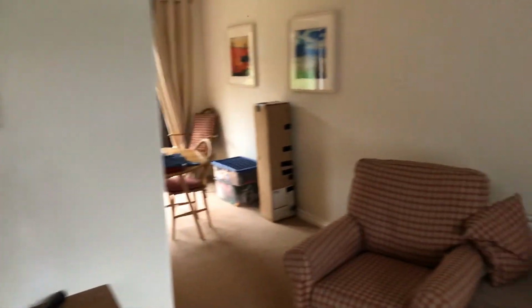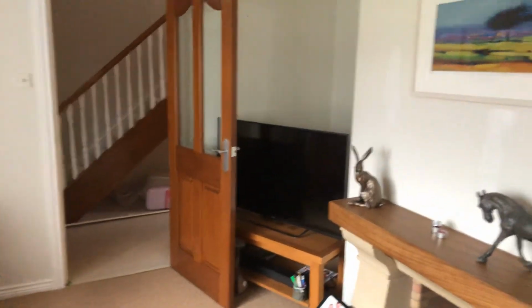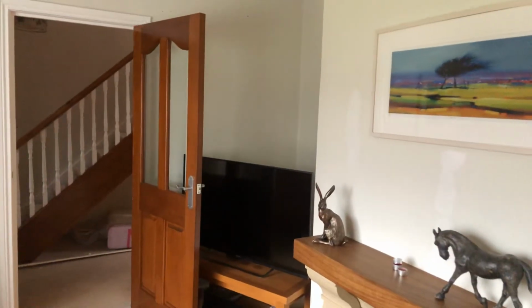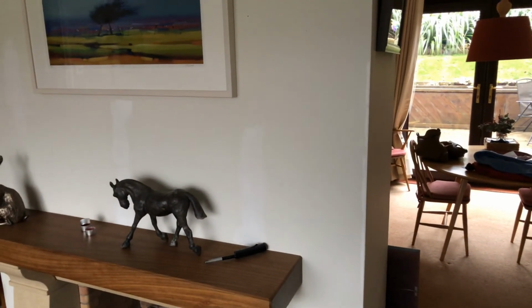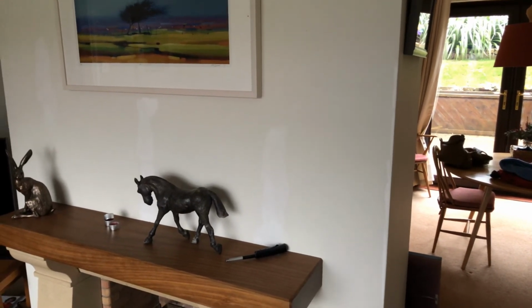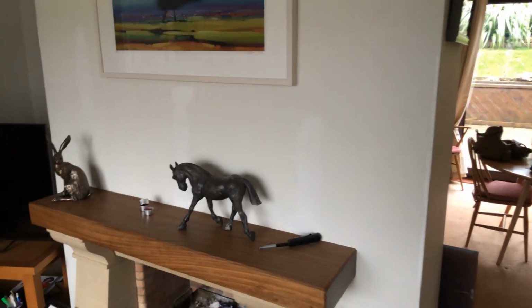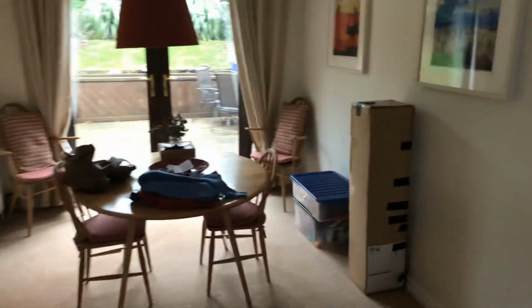But what happened here was the heat was on when I was doing this, and even when you're hanging wallpaper, if you read the instructions, it does tell you to let the wallpaper dry naturally, keep the heat off. So a few of those wee joints just expanded a wee bit, but it's not a big deal. We drop a filler in there and that's it. So just look through into the hall again, you can see those wee spindles. See, this colour's all the same. It's on through into the dining room.